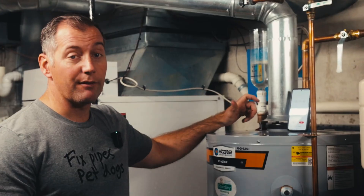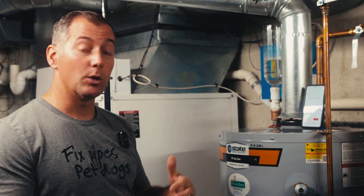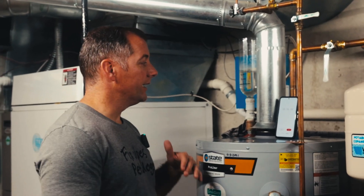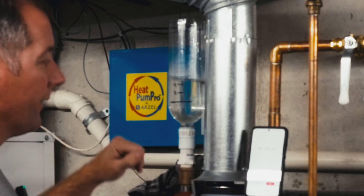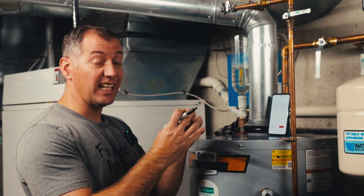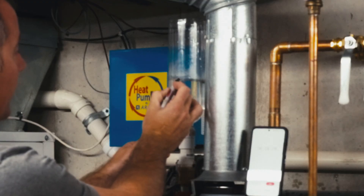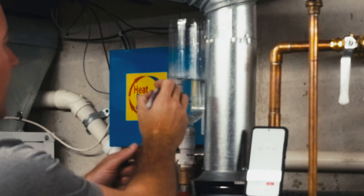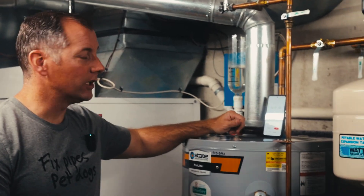All of this water right here would have to go somewhere in a closed system. We're getting a couple of air bubbles working through — because we drained the heater, there's air sitting at the top, and that's actually going to distort the next reading. Those air bubbles were taking up volume, so as they came through at six minutes the reading is just under the others. I tried to get all the air out before we did this but it's kind of hard to do, and we might get a couple more air bubbles working through.